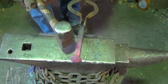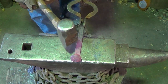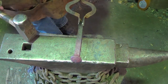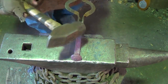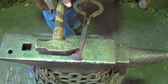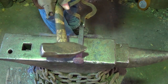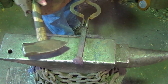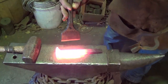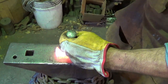Another thing you might be able to do if you're good at upsetting is create a nice little round disc to provide stability and turn it into a candle holder that holds your stockings - though you may have some liability when the stocking tips over the lit candle. But we're going to heat it up and slit it - I'd say about from here, and using the mason chisel, about that much of a slit.